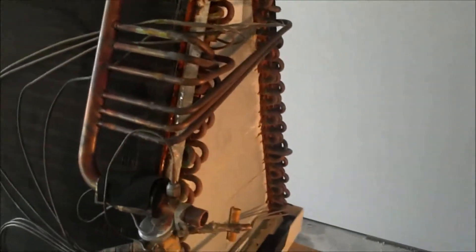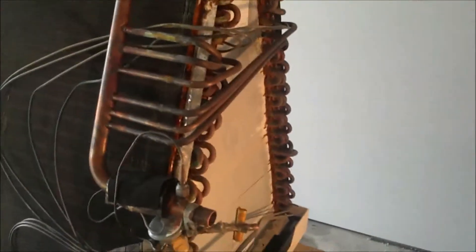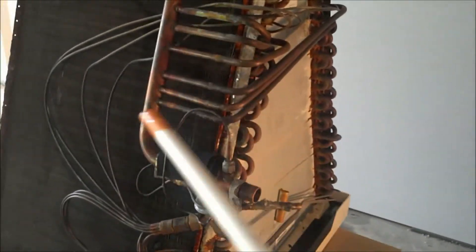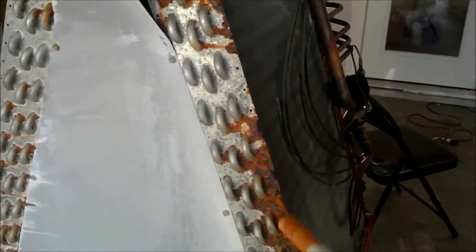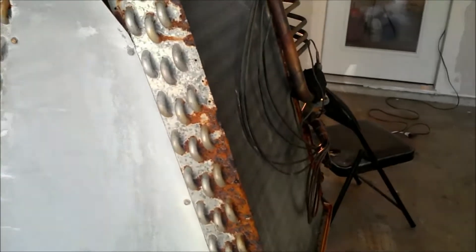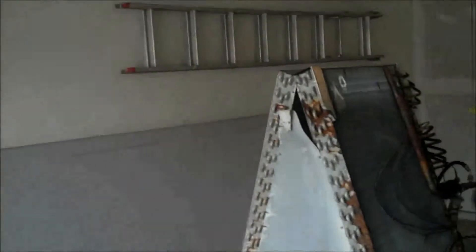This one is likely going to be fairly easy since I've already leak-tested it and know it's leaking pretty badly, but it's just to show you what I look at. This particular coil is a builder's grade coil — copper with aluminum fins and steel side panels. This particular manufacturer went a step further and tin-coated the coil, as you can see there's a silver-type covering on the copper joints. Really it doesn't matter — manufacturers coat them with oil, special coatings — but in the end, if it's a copper-aluminum fin-and-tube coil, it's going to leak at some point.